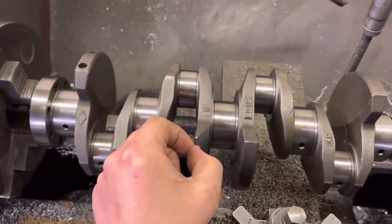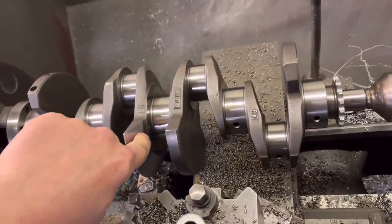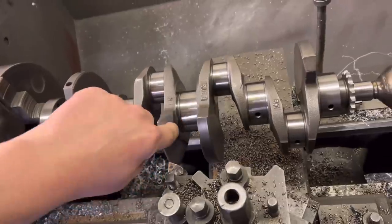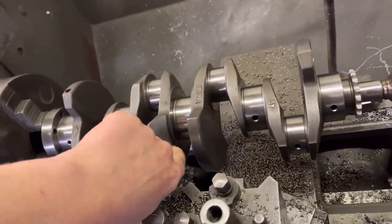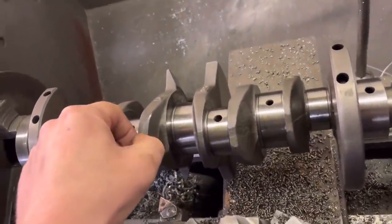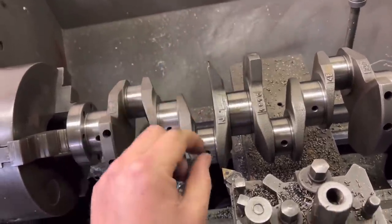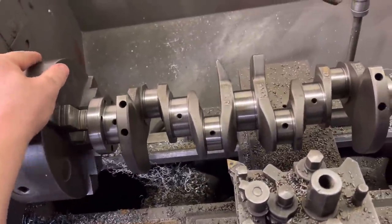Because we're cutting backwards, we decide how much thickness we want to leave and where it's going to go up to, and that determines the angle you set. We figured 25 degrees on these Renault 5s gives you about two and a half to three mil on the front and goes right up to as far as we'd like. By doing that amount it just starts to cut on this back edge, which is perfect. We don't want to remove anything off there because that part is purely your weight and your strength, so as long as it's just a little lick over, that's enough.